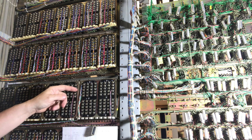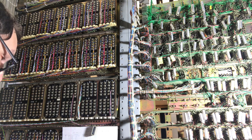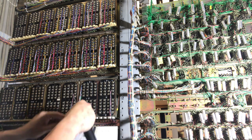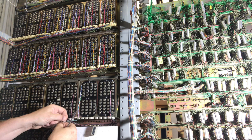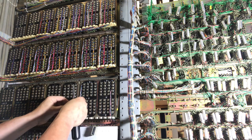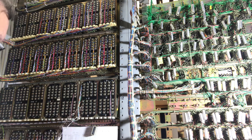So I have three pairs connected, and then I will do the next three leads, which would be the white-brown and white-slate. Then I will continue on and do the same process as before. Then I should have the white-slate down on number nine.